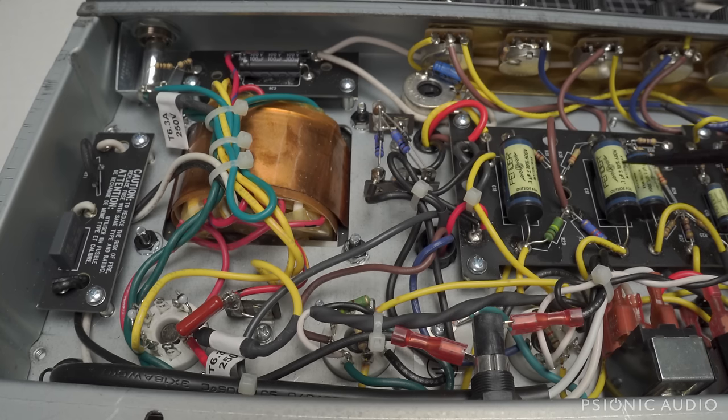And here you can see these fake blue molded caps to look cool on the gear page, I suppose. They're supposed to be a callback to the old blue Ajax caps from the 60s. They're nothing like the blue Ajax caps. This is a standard cheap cap that is then covered in blue molded plastic and given a vintage looking label that says Mylar 10 wax. It's hogwash. It might be a Mallory 150 underneath there. You're paying a lot for cosmetics that few people will see.